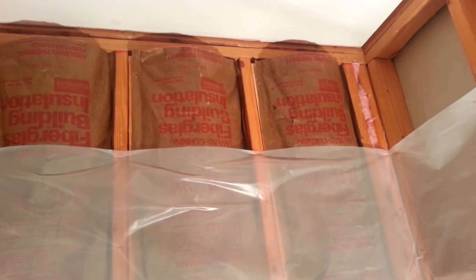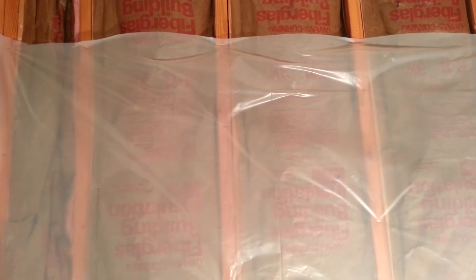I still have to cut out the plastic here. I put plastic on for a vapor barrier underneath. There are some that say do and some that say don't. On an outside wall, if you don't have good insulation, some of that cold air can come in and condense on the plastic and run down. But if water seeps through your tile, it can go the other way through a crack. So I said, let me leave the top open there — don't go plastic all the way up on the outside wall, that'll give it room to breathe. Hopefully we don't get condensation if a little cold air comes in. We're not where we get real cold weather here in Austin, so I'm not too concerned. Up north, maybe I'd have to be a little more concerned.